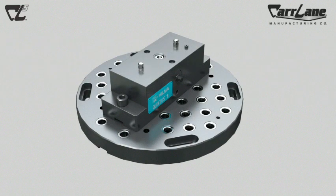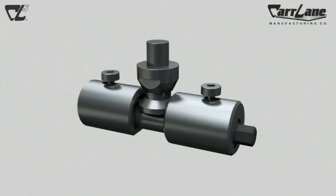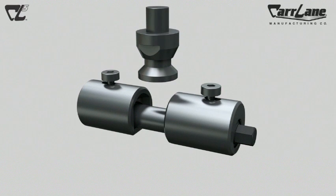The Quintus 1 locates using a fixed position round and diamond pin mounted in the Quintus body, and a Quintus clamping pin for clamping. The Quintus mechanical zero point mechanism uses two wedge-shaped cylinders to concentrically clamp and locate the Quintus clamping pin. This provides a simple, robust, and accurate system that requires as little as a single clamping pin, unlike other systems that often require as many as 4 clamping pins.